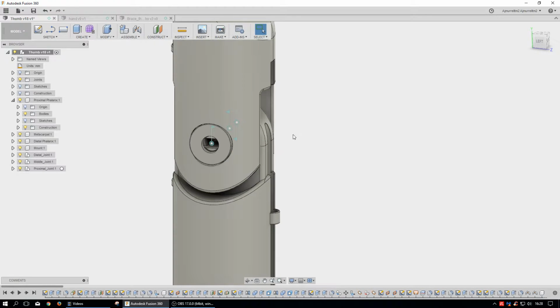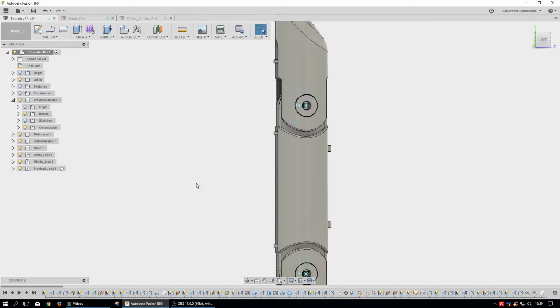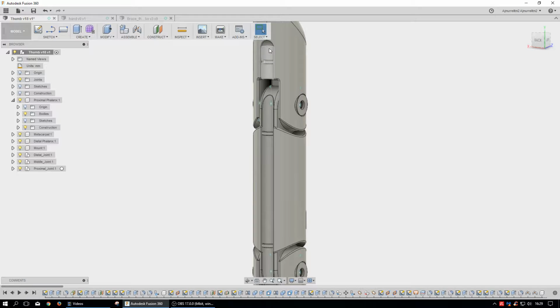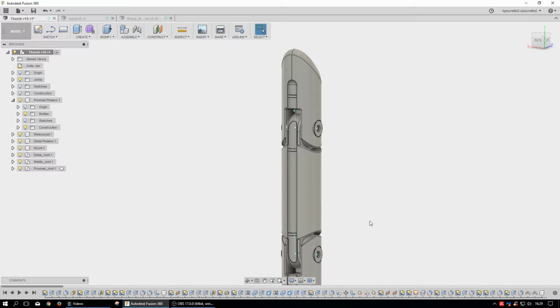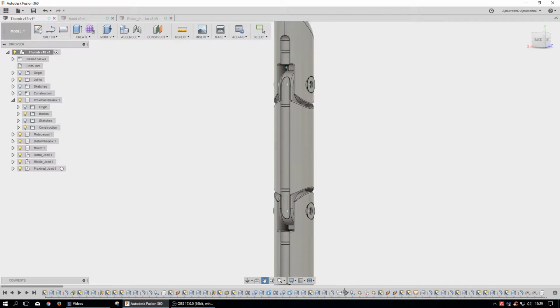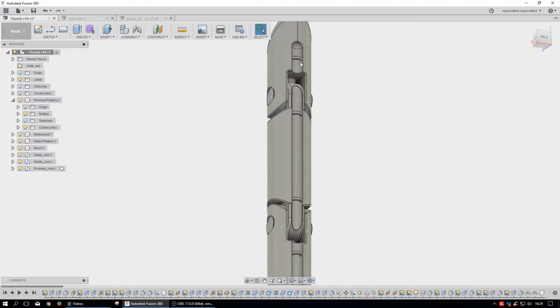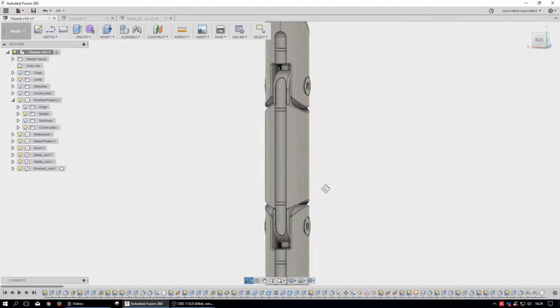So back to the thumb. I had to figure out a way to retract the thumb, first of all. And so this is this channel here, and it's just going to be a piece of probably elastic cord that runs down, and I haven't made a mount to where it's going to mount to the brace yet, but it would run the length here, and all that would do is a passive tension type of thing where it would pull the thumb back.